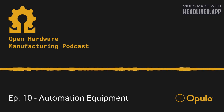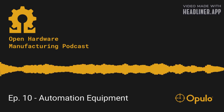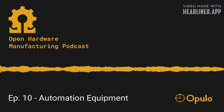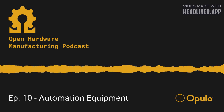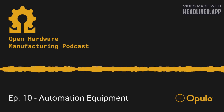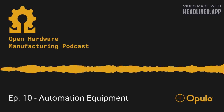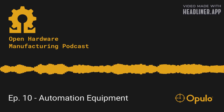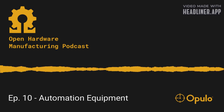The first real example was the MoBo Pogo pin jig — that was so important. When we did our first batch of 100 machines, we didn't have that jig. For every single one of those boards, I had a multimeter in continuity mode and I checked every single pin on that TQFP-100 to make sure it was connected to the peripherals — that's like 10,000 continuity connections or something. It was unsustainable. I didn't want to give it to anybody else because you have to understand how it was designed to know which pin connects where, and very specifically not here.